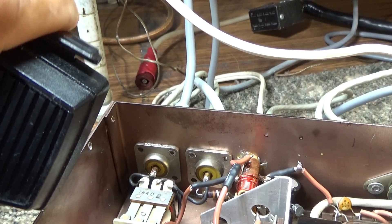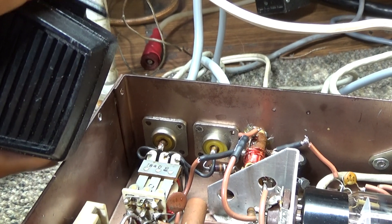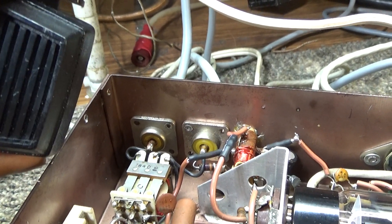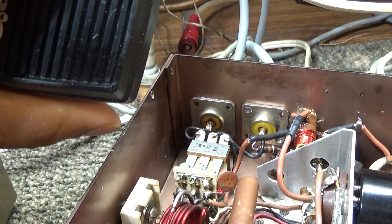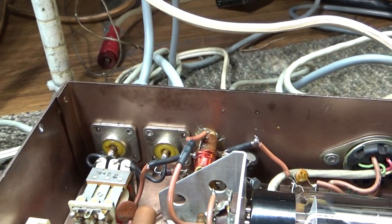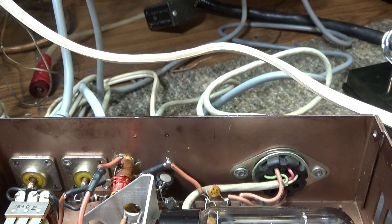A little slow for AM, a little fast for SSB. It's about a half-second delay - for SSB delay you want about a second and a half. For AM you want about no delay - you want it to key up and go right away. I'm unkeying and keying and the delay is just holding it in there. For AM you want that thing to click in and out just as fast as you key and unkey. About half a second is the compromise that Black Cat did.